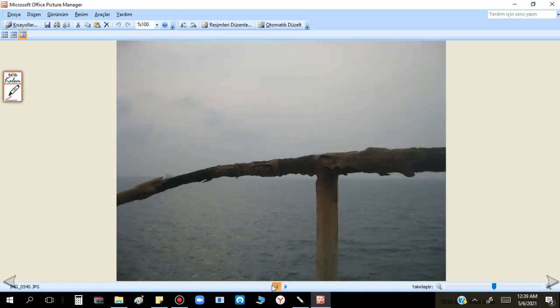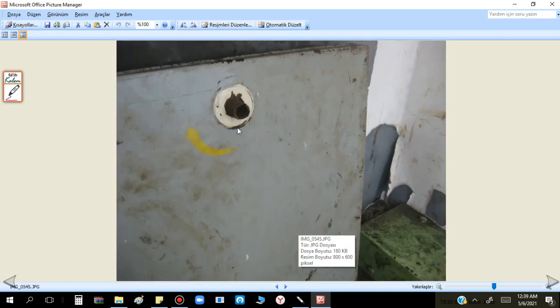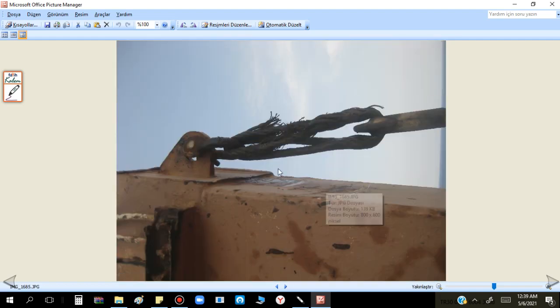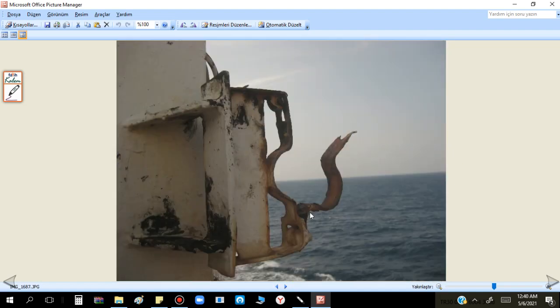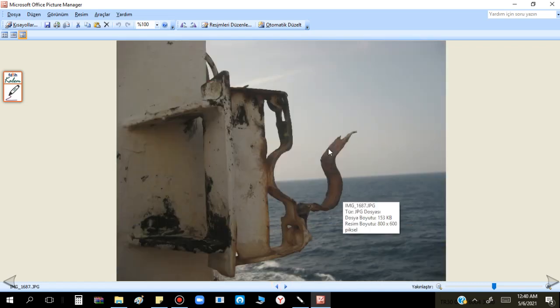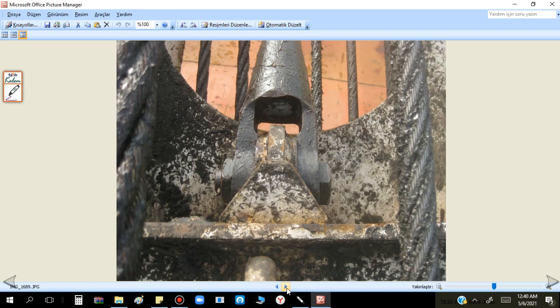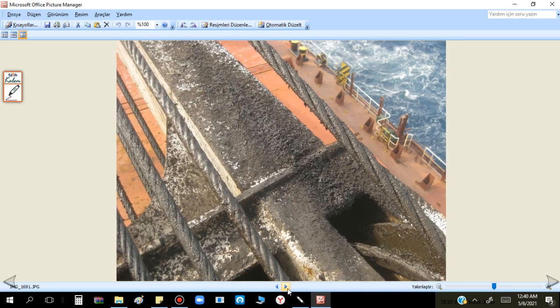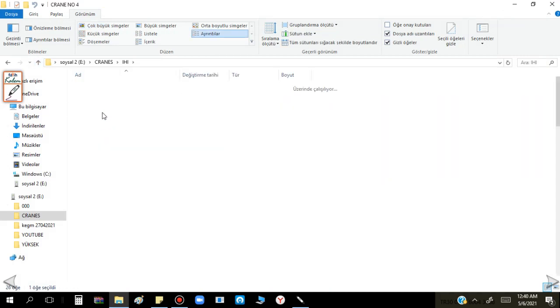We check the railings. These railings - when you go up, always be careful, my friend. This is already wasted. Also when you enter the cabin the handle is missing, the lock is missing. This is for securing the ship - as I told you, when you put in parking position they just secure. This wire sling is already wasted. The light foundation is already damaged - this is important because the lamp can fall during operation. We check the socket and then the jump preventer.